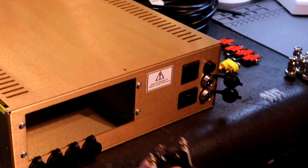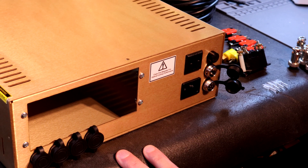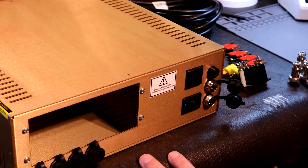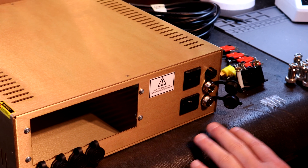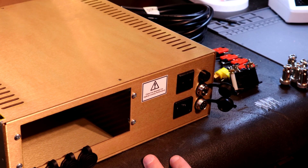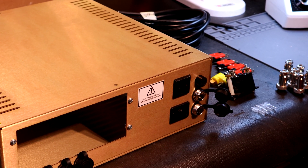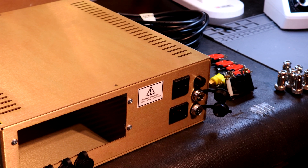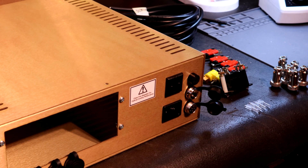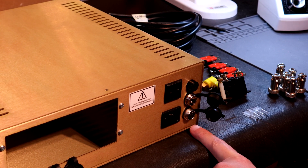The relay option will allow you to use it with the G540 in a tool-less fashion. You can see the thumb nuts so you can cycle your VFD on and off and manipulate speed. Just so everyone is aware: just because you can manipulate speed through Mach 3 does not mean the speed represented in Mach 3 is 100% accurate. You can calibrate and calibrate, but typically it's going to be off. If you incorporate an encoder — which is nothing more than a tachometer — that will make sure your VFD registers accurate RPM in Mach 3. A lot of guys still want the availability to manipulate speed, so that's why this option is included.